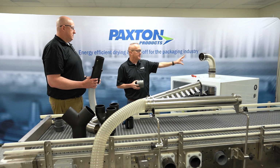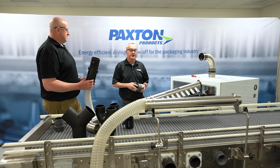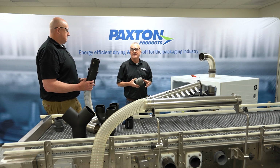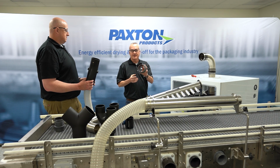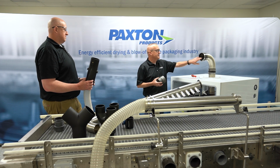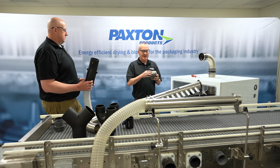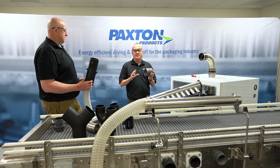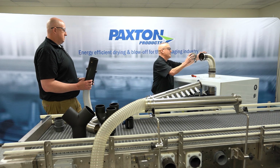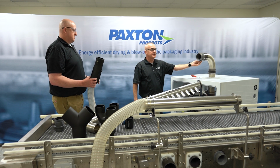The stainless steel tubing is pretty self-explanatory. It would just butt up here and you would run it over and connect to the divider. If you're going to run it in PVC, we would recommend that you use the zero loss adapter. What it does is it transitions smoothly from an OD type style tubing to PVC. You would use PVC primer. It would get glued into your Schedule 40 PVC, and then that would connect right in, just like that, into your connector sleeve. It would get clamped.